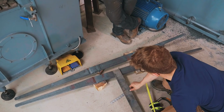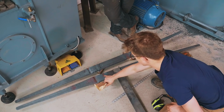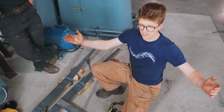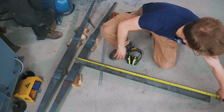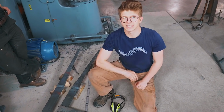I wanna have this piece of flat stock riveted onto this in the middle. That'll mean that when we bolt this to the tabletop, it can be unbolted and rebolted without the legs moving and getting switched around, so it'll keep things level and nice and even. Now this piece here is about 4 foot long or so, which should work dandily for our 6 foot tabletop.